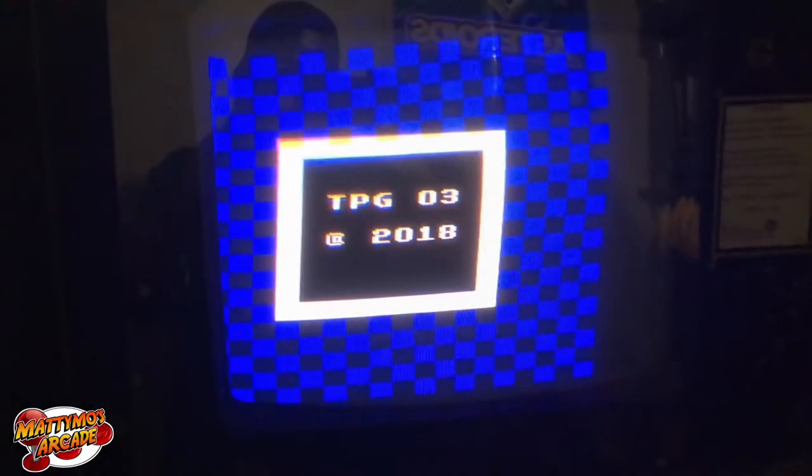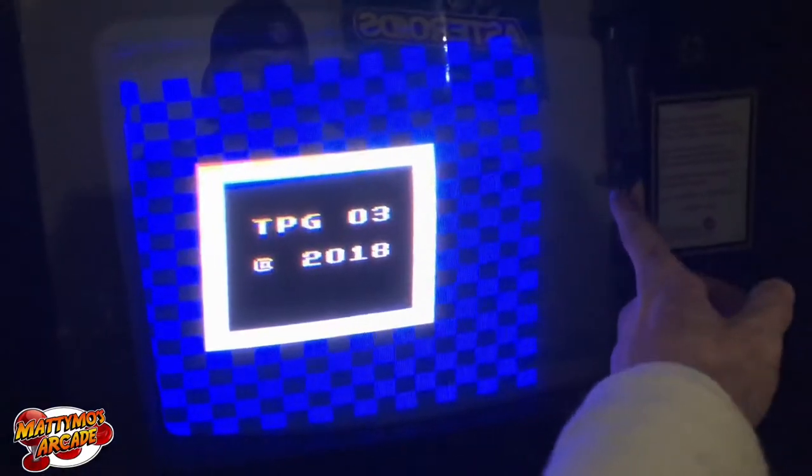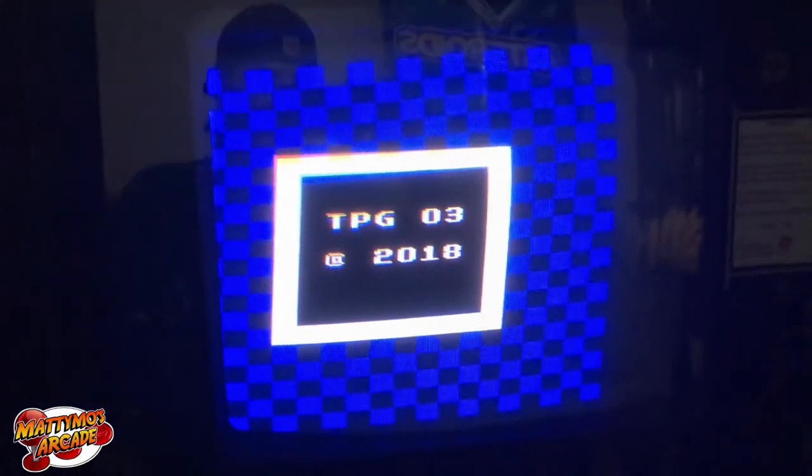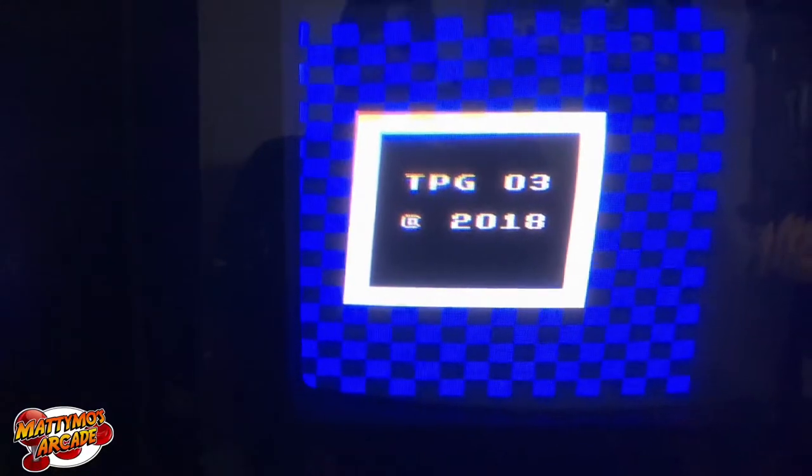Not the exact colors I'm looking for, but that could be the TPG — I could have it on there backwards — but it is working. I just need to do a little adjusting. The image doesn't seem quite stable; I need to check the B+ as well. It is starting to stabilize now. It's just out of whack and the wrong colors. We've got kind of a Nike swoosh up here at the top and a whole section of blank over here, so it looks like the pincushion is off and we need to move it left or right, and there's convergence too.